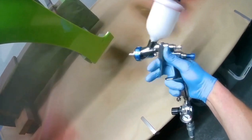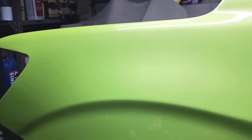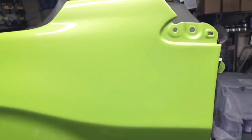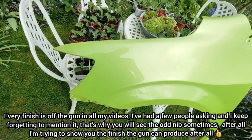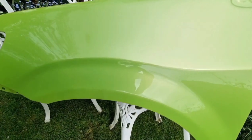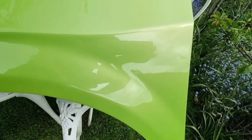It's highly recommended if you don't mind the price difference - it's around about twice the price of the standard brown BA4J cap Kiwami 4 - and you're not after a fast gun. It handled all the stuff I put through it including clear coat. I actually think it makes a really good clear coat gun, but it benefits from a better quality clear coat - one where you can put less material on and still get a nice flow. With better quality clear coats that flow out well, you're relying on getting an even spread rather than volume, and then that flows to give you a nice flat finish.